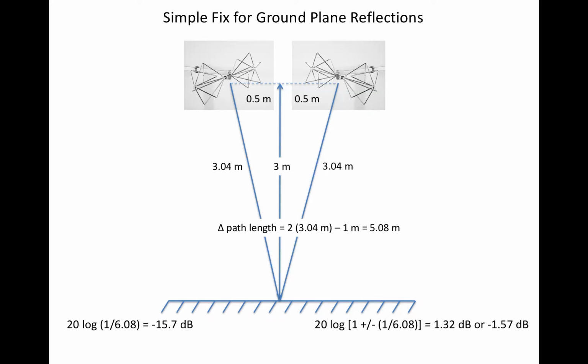Instead of trying to get the antenna away from the floor to minimize errors from reflections, today we can economically make the floor go away. This wasn't practical for the typical EMI test facility in 1968 and was still expensive in 1992. But post-2000, at many EMI test houses, eliminating the floor and other complications could be done with existing test facilities.